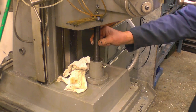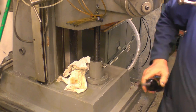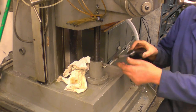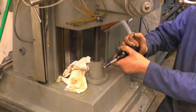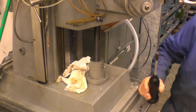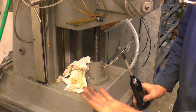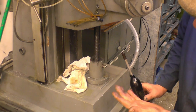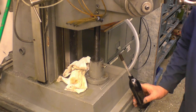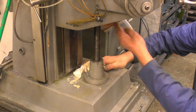I made a new Z-axis feed screw nut quite some time ago — a longer one — and I did put a grease nipple on the bronze bush in there. It's squirting grease in like that, and that's all it takes to keep it nice and lubricated. It's black because it's got copper-based grease on it, which is a really nice grease. You can see the oil is getting to the various places because it's coming out underneath here.